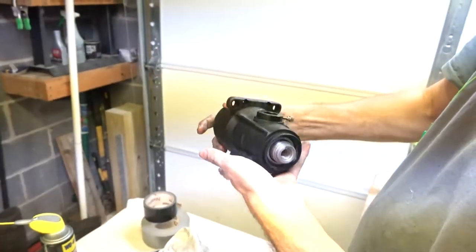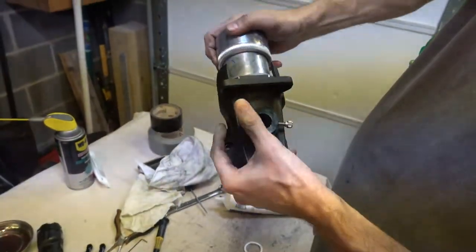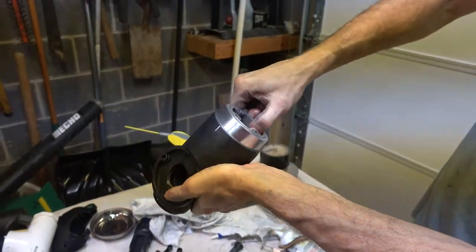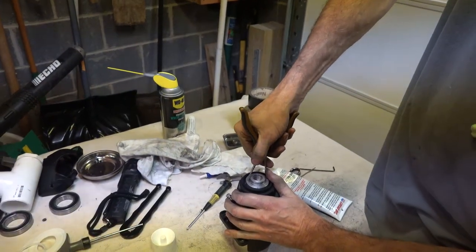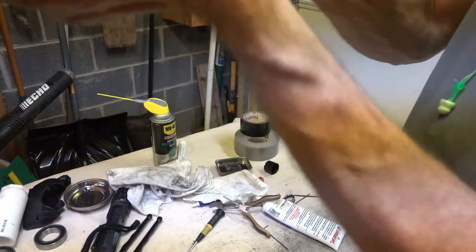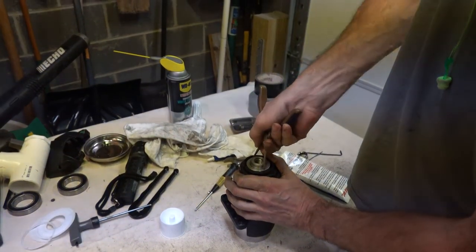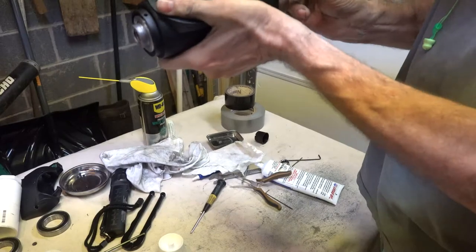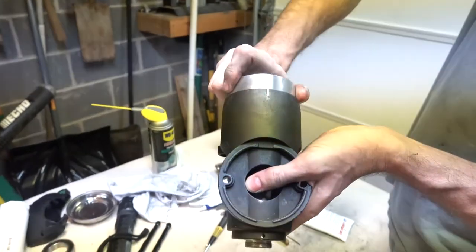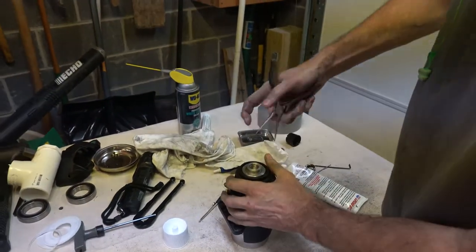But, as Professor Moe says, while you've got them out, do them all. Then you can't. Too tight. If it's too tight, I can barely turn it. Versus a half a turn. Too loose. So I have to get rid of that and still turn freely. And then this also has to turn freely as your clutch release, so your mount will turn as you release the clutch.